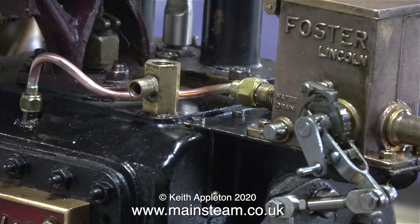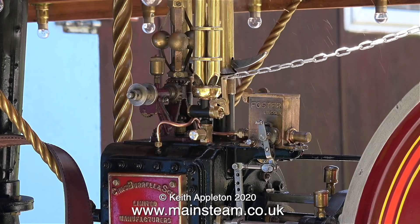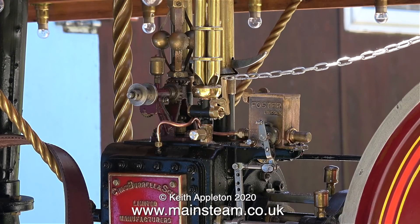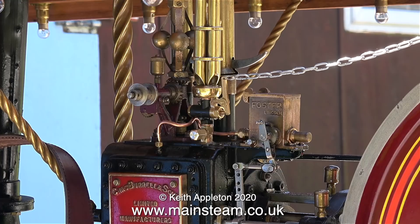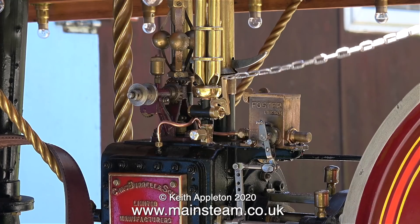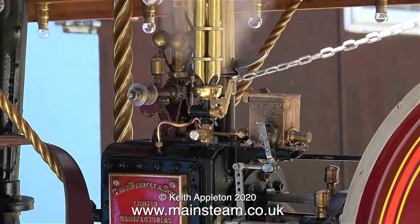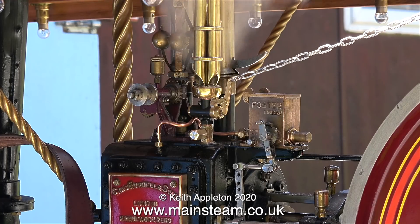The fitting in the centre on top of the cylinder is for the whistle, and the junction on it is so I can pipe some compressed air into it quite easily. During the steam test, what I found annoying was when I blew the whistle — especially when the pressure was low — lots of water gushed forth from the whistle and sat on top of the cylinder. After a while it boiled off with the temperature of the cylinder, which was okay until the next time I blew the whistle and the whole process started again.